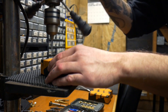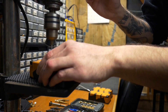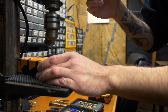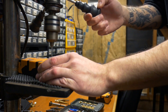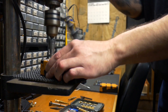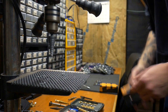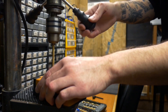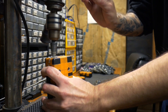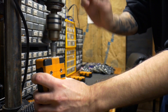I like to start off using a very fine bit and drilling out the pilot holes first for everything, then switching over and doing the same to the top before I use a step bit to make everything the proper size. Just have your components ready — your pots, your footswitch, your LED bezel, and the jacks — to make sure you're drilling the correct size hole in the right spots and that everything fits. I used a different bit for the LED bezel. Wear safety glasses, don't wear rings, don't wear long sleeves, and don't wear gloves when using a rotary tool like this.